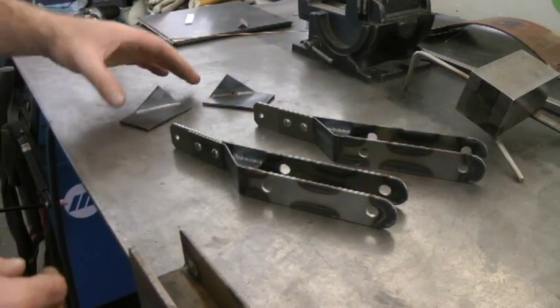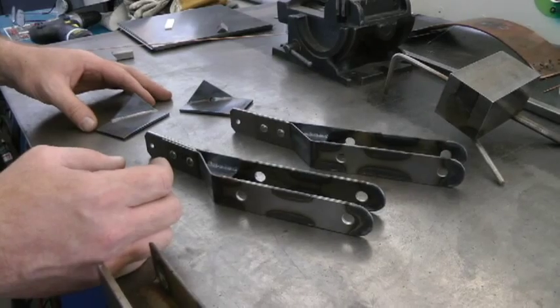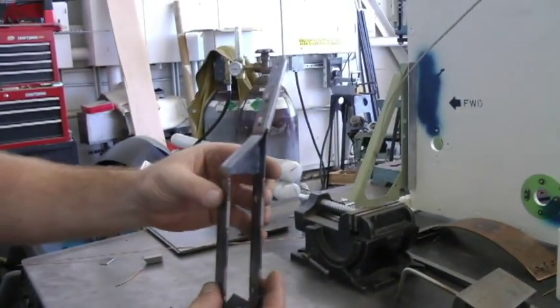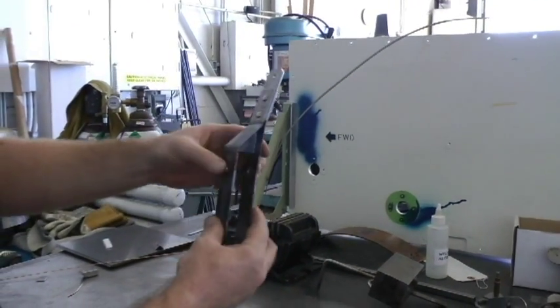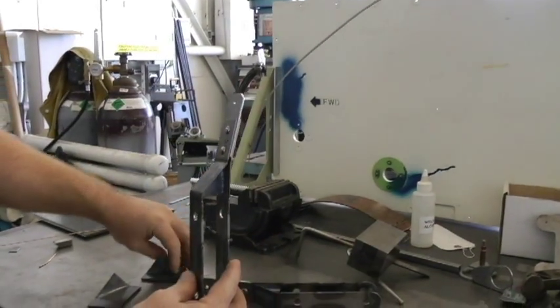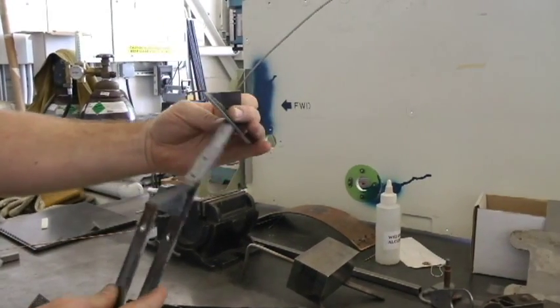So now we're going to show these are the sling attach points for the empennage, which is disconnected from the rest of the aircraft. These guys go on the front stabilizer attach points, or the actual bolts that hold the stabilizer to the fuselage. They get put in like that, and they're tipped forward. And then these go on the number 10 bulkhead on each side of the airplane. They're curved to the skin.